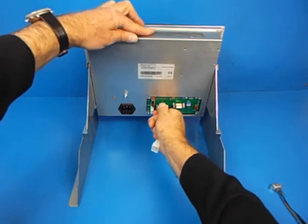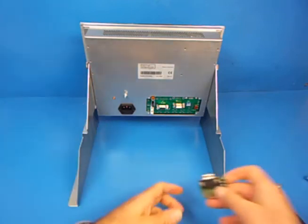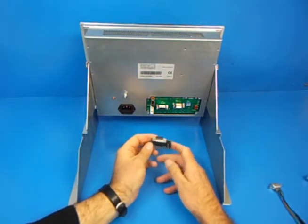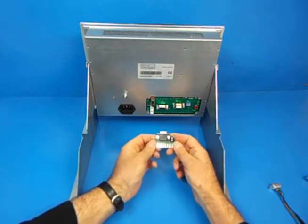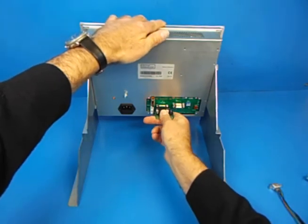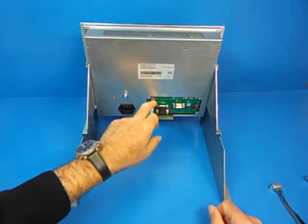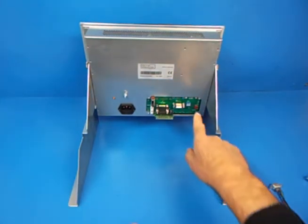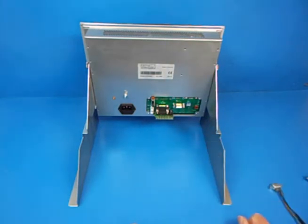Lastly, if you have the M-Plus or T-Plus, you'll use this little adapter board, which is a 15-pin sub-D connector to a PCB edge connector. That just fits in here — make sure it's firmly seated. The switch needs to be in the down position, keep the sync switch in the H+V up position, and those S10 switches stay in the down position. And that's it.